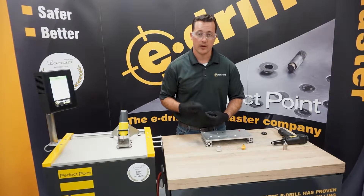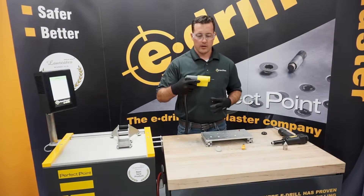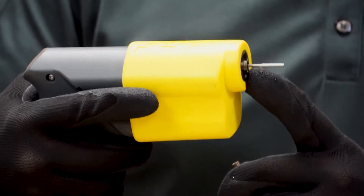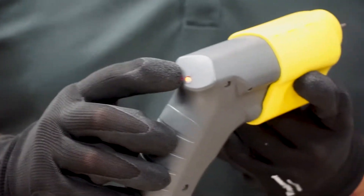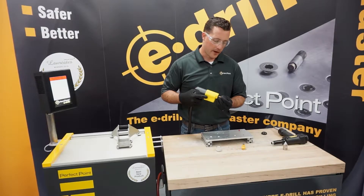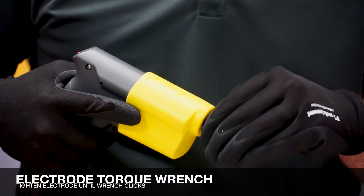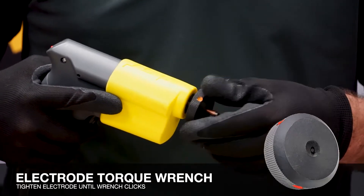I'm going to install it to the hand tool. Step two: install electrode. To install the electrode, you're going to pull the trigger and extend the conducting tube all the way out until the hand tool stops itself. When we get there, we have a red light on the back and our touch screen display says 'cut aborted — forward limit found during seek.' That tells you we are at the maximum limit of what the hand tool can extend. From there, we twist on our electrode based off what the touch screen says, then use our electrode wrench and tighten that up.